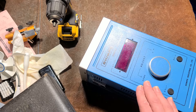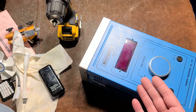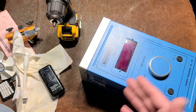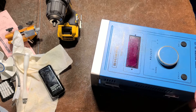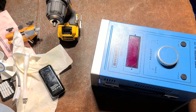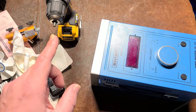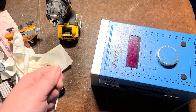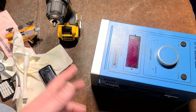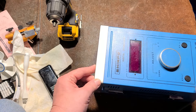This stroboscope just registers cycles — whether something is rotating or a jigsaw spindle is going in and out. These are used in industrial environments where you can't effectively use a contact type, or the simpler photo type where you have a piece of reflective tape and point a counter at it to count reflections per minute. This one instead uses a strobe light.